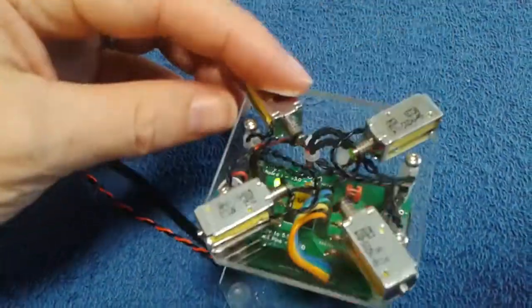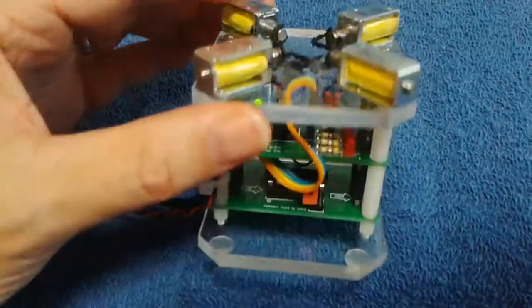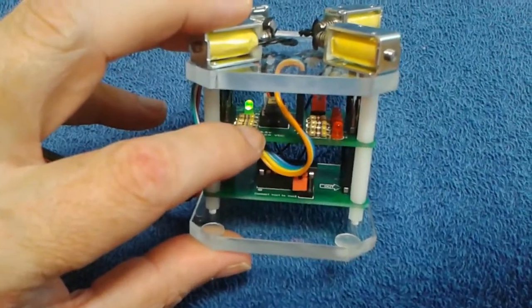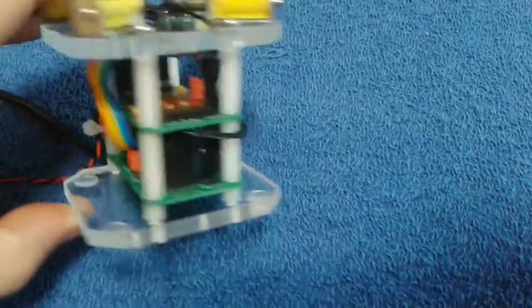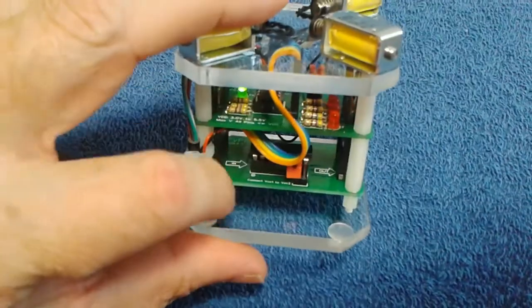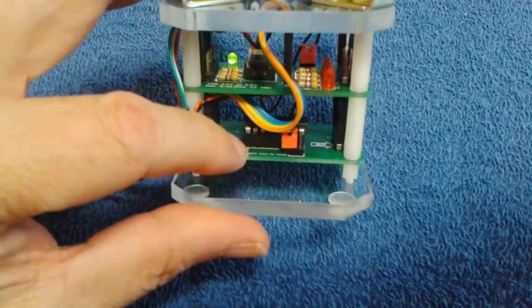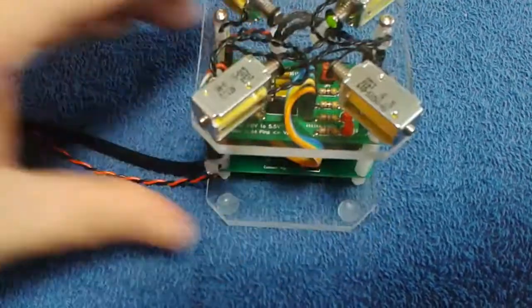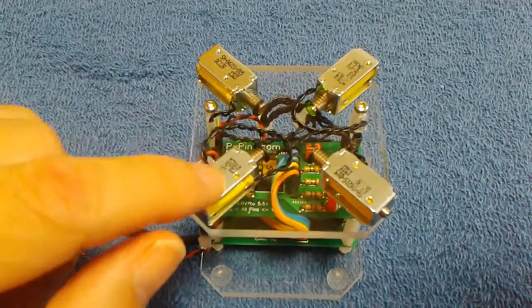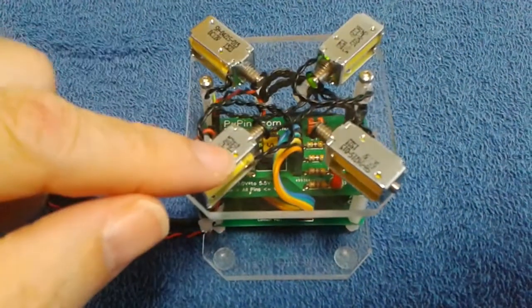Basically what we've got here are some solenoids. This is the controller board right here, and it's actually playing the bossa nova right now at 240 beats a minute. We've got a power board down here — this is 5 volts running off the USB, and then this is 12 volts down here. We have an auxiliary power cable right here, so that's what actually runs the solenoids, because they won't run off the USB — it's not enough amperage. So we're running these solenoids off of 12 volts.